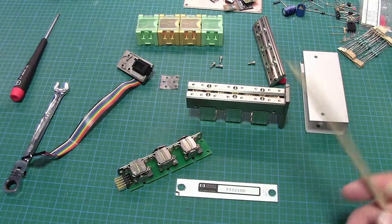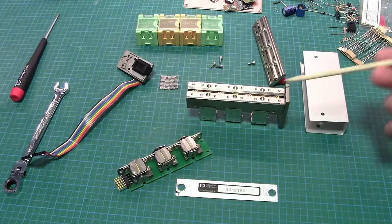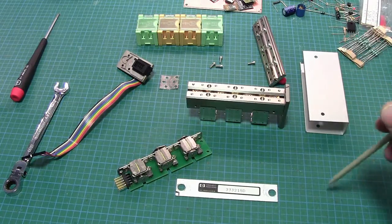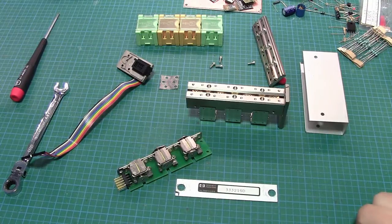The second mistake that I made was that inside the 8642B, each attenuator module is different. It's got a different set of pads. So one of them has a set of pads of 5, 30, and 40, which is what this guy was, for a total of 75 dB, but not in 10 dB increments or 5 dB increments even. And the other one was a 10, 20, and a 40 dB. So between the two of them, you had 145 dB of attenuation, controllable in 5 dB steps.